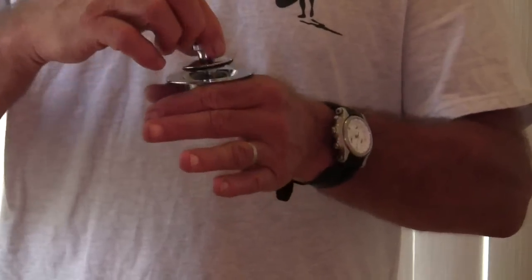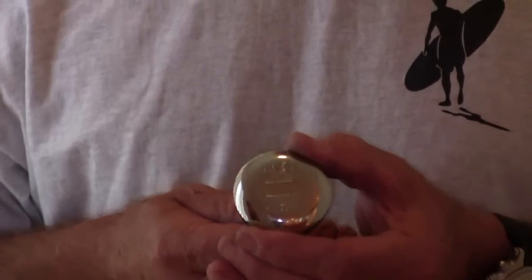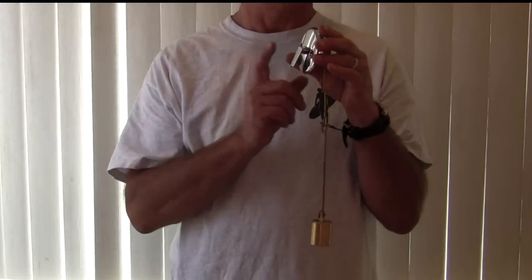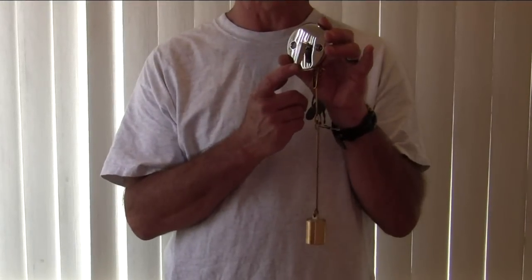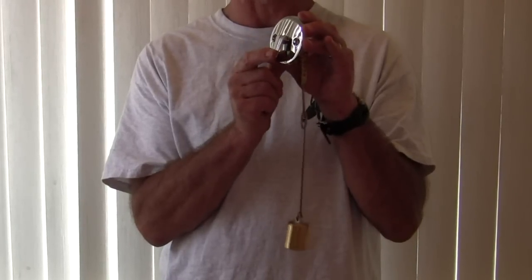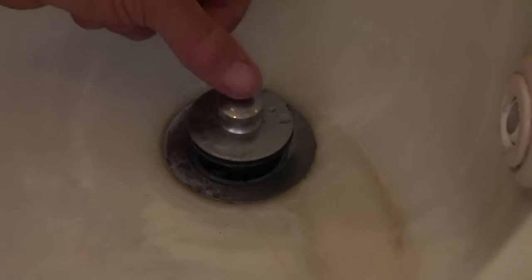In this video we're going to talk about how to clear a tub drain, and a little bit about those stoppers that hold the water in the tub and how to remove them. There are four types of tub drain stoppers: the lift-and-turn, the open-and-close where you push to close and open it, the trip lever waste and overflow that goes on the wall of the tub, and the push-and-pull where you just push or pull.